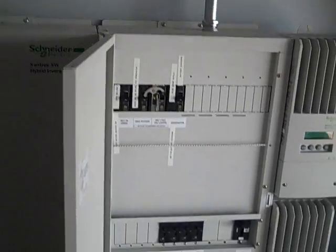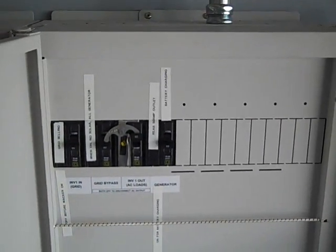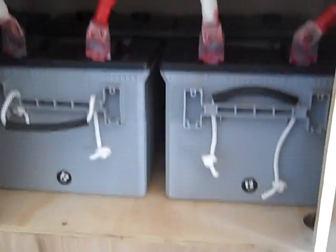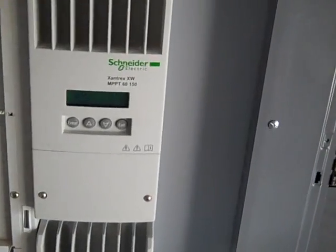Back inside, we've got the battery charging circuit from the two Honda companion inverter generators. On the meter I can see AC one, which is the grid — currently off at zero volts. I'll throw the breaker for the small generator and bring it up. It settles out to 120, 122, 123 volts. The batteries are nearly floated so not much is going in, and the solar is also producing.